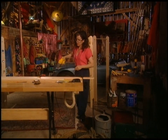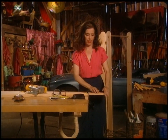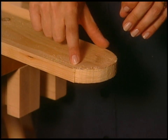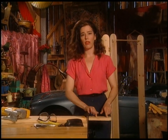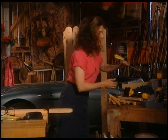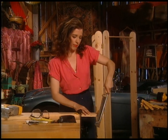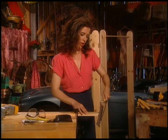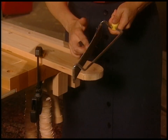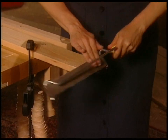There we go. Now it looks a little bit hacked up, and that's a pine thing — it's really soft wood. You can tell it's soft wood because you can actually make a dent in it with your fingernail; if this were a hardwood that would not be possible. You can clean that up with some sandpaper, or sometimes I use a metal file because they do a nice aggressive job. This little tool is called a sand bow — it's flexible, so it takes the shape of whatever you're sanding.